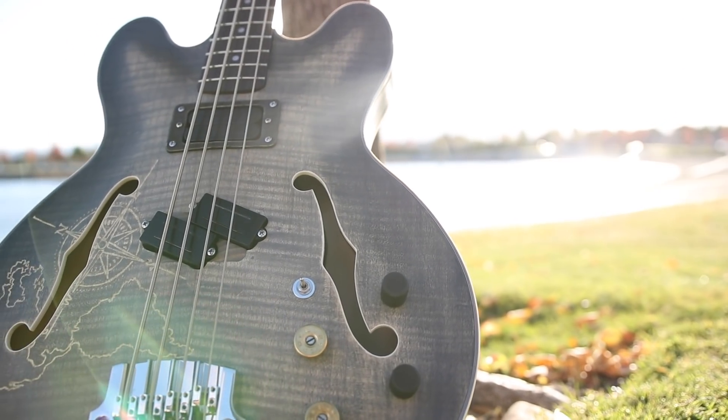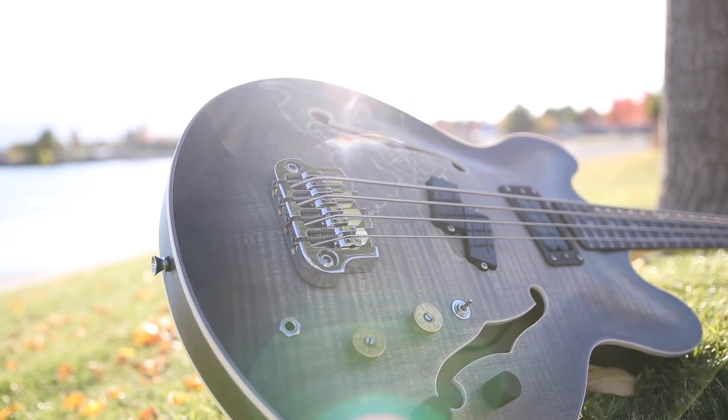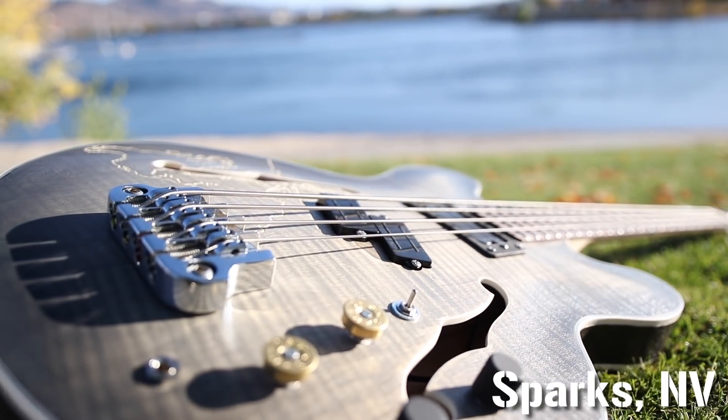For the control layout I did a pretty simple jazz bass wiring: individual volume for the neck and bridge, plus bass and treble controls for the preamp, and an active/passive bypass switch. That bypass switch is super necessary when running an active preamp with passive pickups — if your battery dies mid-gig you can switch to passive instantly. I also strung it up in B-E-A-D tuning because I really wanted a deep, grizzly, overdriven tone — sort of an indie, Scott Pilgrim-style tone — and that's where this bass really shines. Check it out.